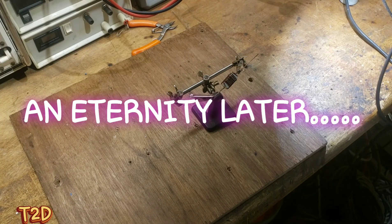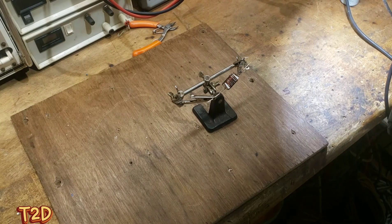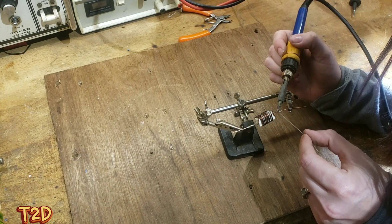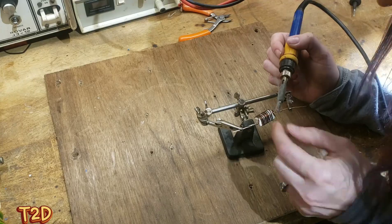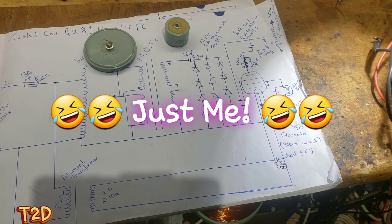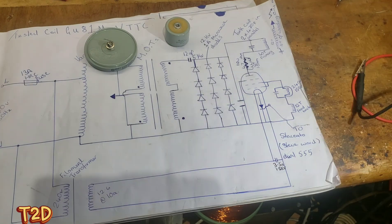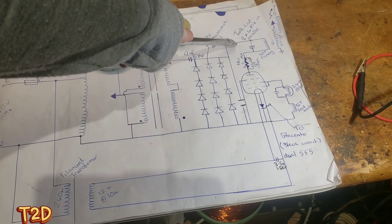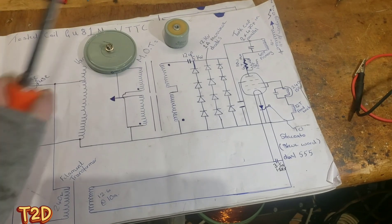The schematic called for a 10 watt resistor but I could only find a 5 watt, so we'll see if that works. I've wound 12 turns of 1 millimeter wire around the resistor. Next I'm going to move on to the tank capacitor - the schematic calls for 2 times 470 picofarad in parallel. I've got a couple of options: a 1000 pico or an 800 pico capacitor.